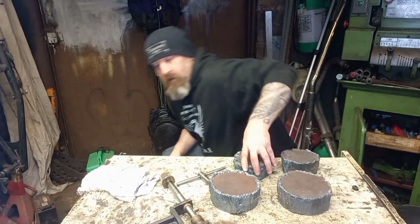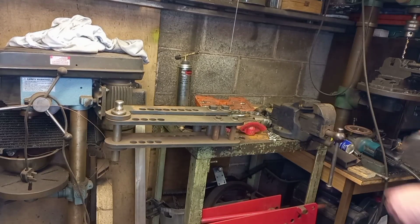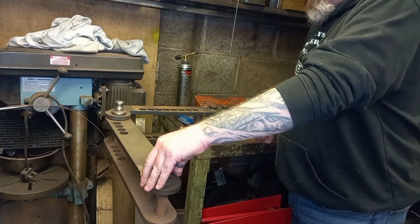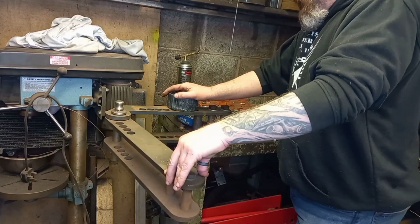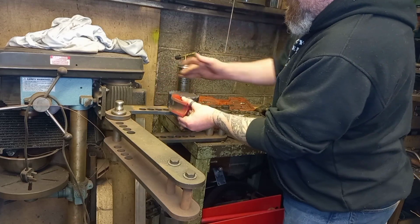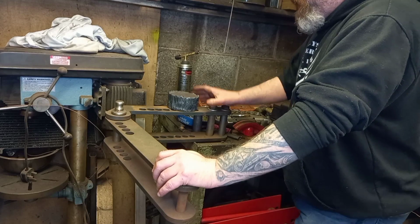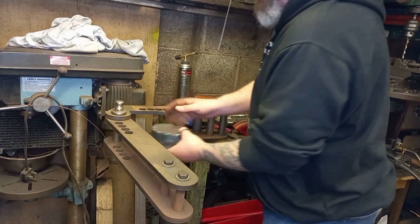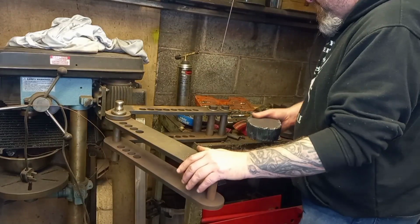I've got the bender machine over there, so I'll just take it over there and show you. So we can see that. Okay, this is my attempt at a homemade copy of the Pro Tools tube bender. What I need on this thing is a radius the same as what's on that, that I've taken out of this tube crusher 2000 there. I need a 1-inch hole through the middle of it because we need to fit it in there so the tube goes through and this thing comes out and runs the former thing around it.